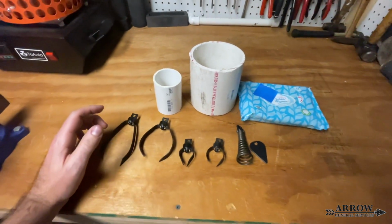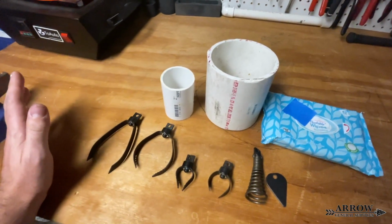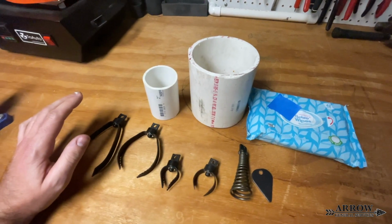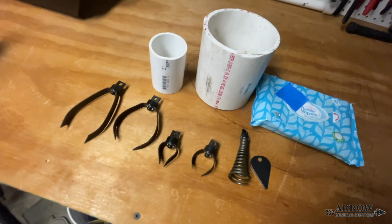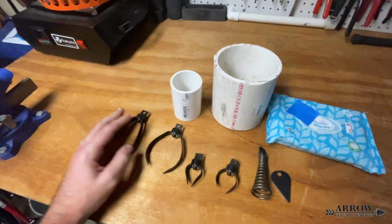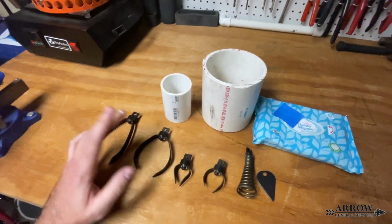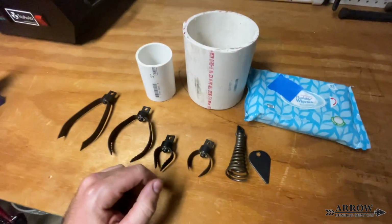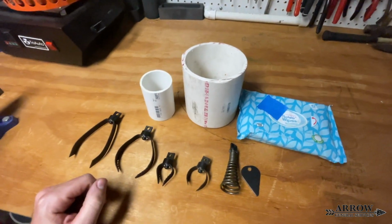The footage that you saw earlier in this video was just a huge mess. So hopefully they got a plumber out there to fix that, because that is definitely against code. Whoever put that clean out tee in the ground like that, that's a shame. So hopefully they got that fixed, because that is probably one of the number one things causing their problem, because the water cannot flow through that. But if they get that fixed and they stop using flushable wipes, they won't have any more problems.